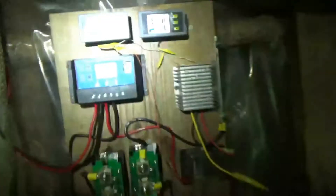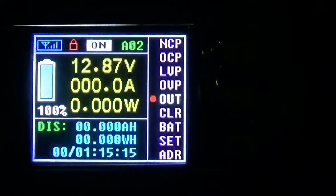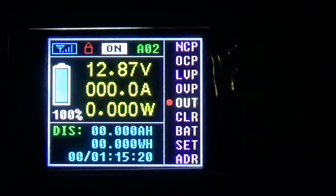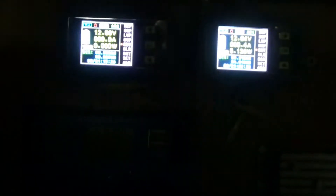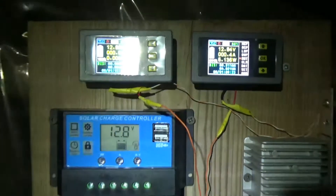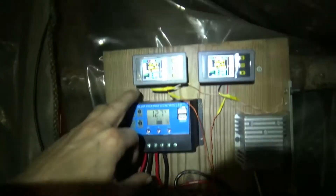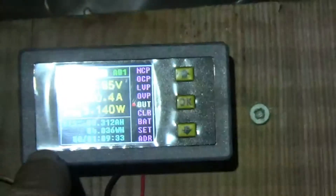These meters are pretty cool. I'll give you a shot of them here. I'll turn my light off so you can see. These are the DRock meters — it's a watt hour meter. It does 0 to 100 amp hours and I think 0 to 120 volts DC. I have two of these set up on my solar powered system for my greenhouse. Coming out of the charge controller going to the battery is what this one is for, so I can monitor how much power we're putting in, and then this one over here is for monitoring everything on the load side of the battery.